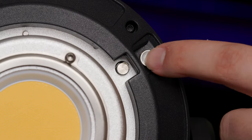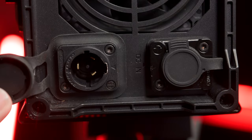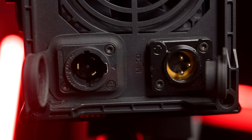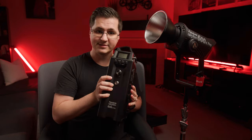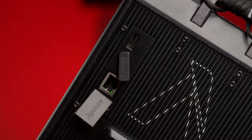The Bowens mount release button is much improved on the 600D — it's a simple push to release and the tension is perfect. The power ballast is a big beefy boy. They've made the most of the space and added a multitude of connections: your AC Neutrik power port on the bottom, just like all your other Aputure lights, and a three-pin XLR DC power port for external block batteries. They've added a lot of networking as well — DMX in and out ports on the bottom, and the unit has wireless DMX built in. There's also an ethernet port for ArtNet connectivity and a USB port for firmware updates. Over-the-air updates through Sidus Link will be coming in a future firmware, but for now you'll need to use a flash drive.